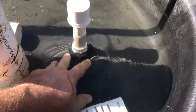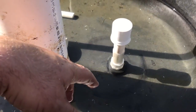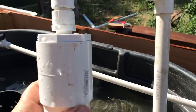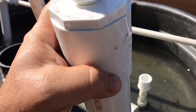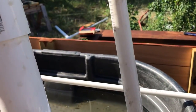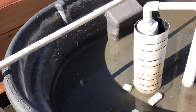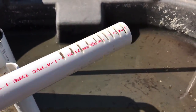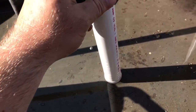It will limit how much water you can get out of the tank to no more than the height of this piece, but you're not really going to get that much more out of it anyway because when you do it with a regular siphon there's still going to be about that much water in the bottom. The siphon itself is really simple: two-inch pipe cut with a chop saw for a nice square cut, a two-inch straight coupler, a two-inch to half-inch threaded adapter, and a half-inch threaded bushing to your half-inch pipe — that's all there is to it. For media excluders, I went with one-and-a-quarter-inch pipe.